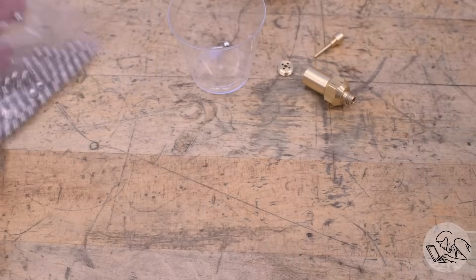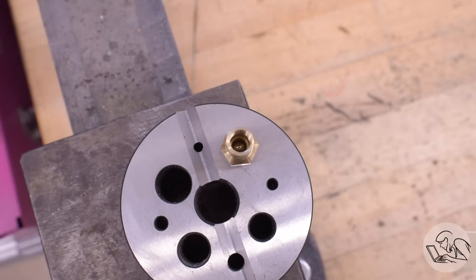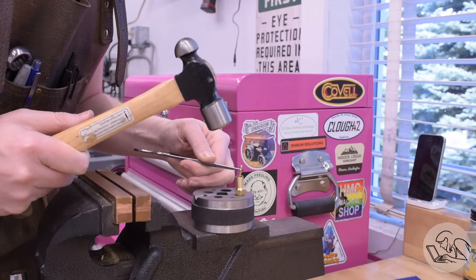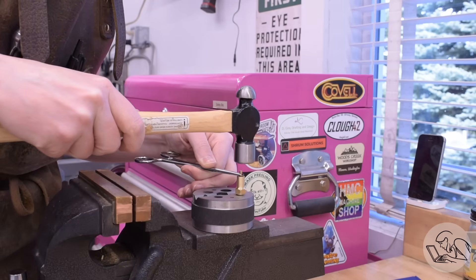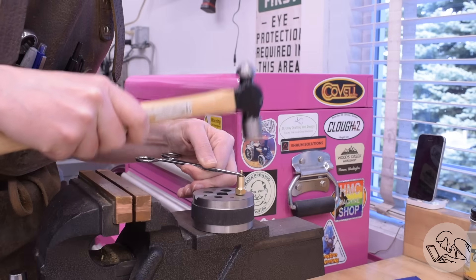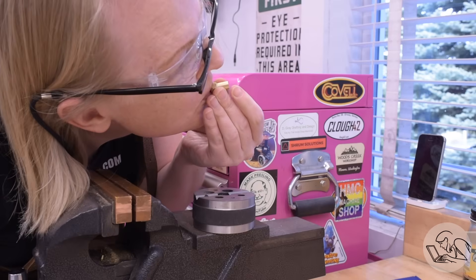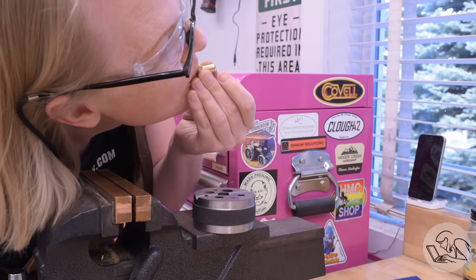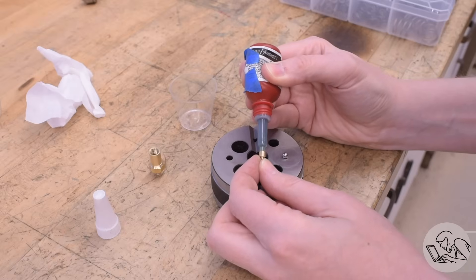There are the three main pieces of the valve itself, and I've got a stainless steel ball bearing that will act as the valve seat. I drop that ball in — you can see it sitting on that little positive cone — and to create the actual valve seat we do one more final operation: with the ball sitting on that delicate positive 15-degree cone, I give it a good whack with a brass drift. That deforms the little cone to form a perfect valve seat. This is an old model engineer's trick, and after that you should only be able to blow through it one way.